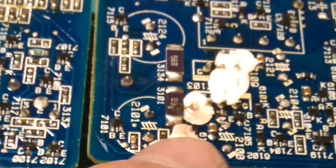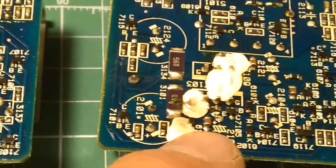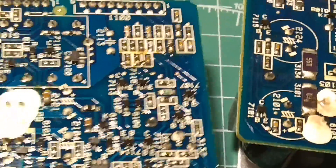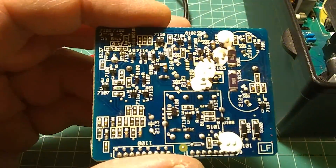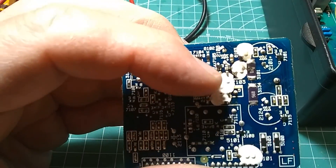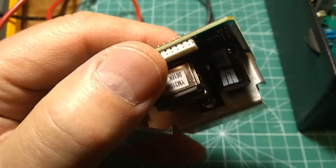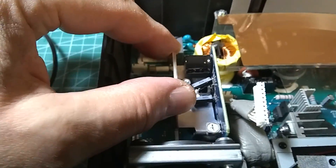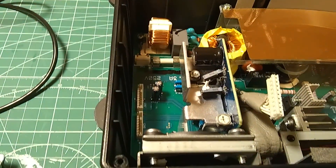I'm going to try to fix this one, but in the meantime, if they need it for tomorrow, I'm going to see if it can run on a single channel with a single amplifier, and then fix it up and return it. I just tested the resistance of the pins on the two MOSFETs and they're both shorted, so this board I'm going to leave aside. For the time being I'm going to put in just the good board and it will be used with a single speaker, but I'm going to put it together and see if it works.